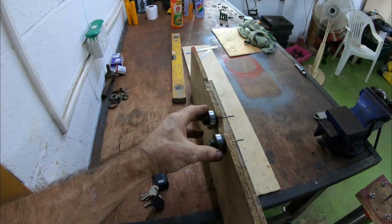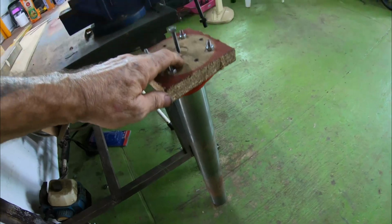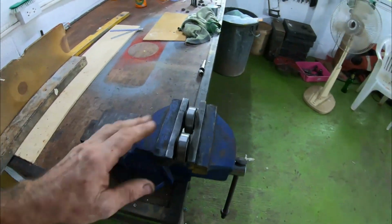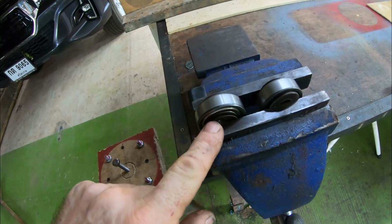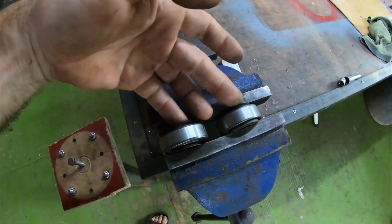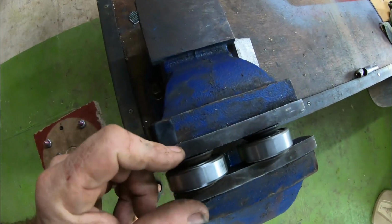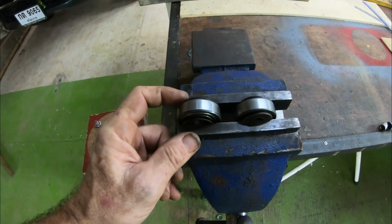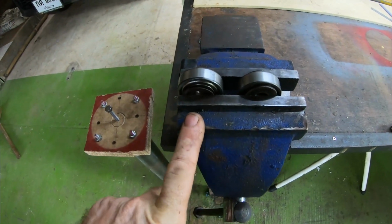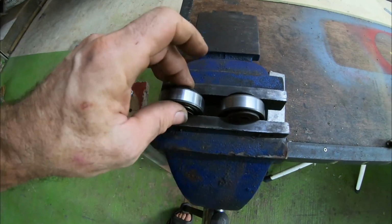Well, there you go, I've rigged up a system that I can now put the tubular stand on and clean it up. Just go over what I've done here. Basically, I've taken four washers or four spacers. These are off of a stabilizing arm for my old Hi-Ace van when I changed the suspension. I always keep bits like that because they come in handy. But anyway, these are holding the inner race, which allows the outer race to spin free,